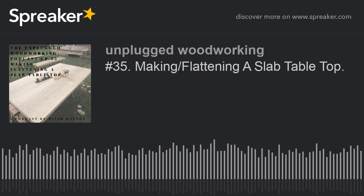So even if he does, I'm going to try and leave that till last. And then, if I do cause any damage, I should be able to plane it out, because I haven't touched any of the edges as of yet, other than the initial planing that I've done, what I spoke about earlier, to make it square. So obviously I'm going to be rounding these edges off. I'm pretty sure by the time I come to do that, there'll probably be a few dings in it. So it's probably just as well that I leave it and I can plane them out.